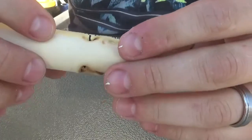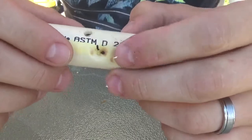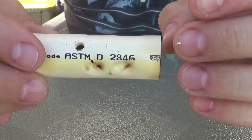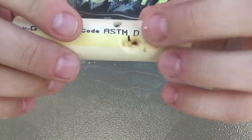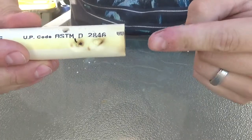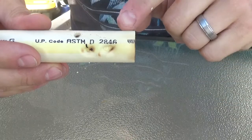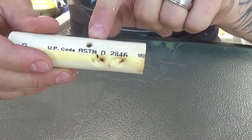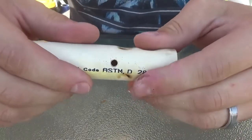This is a good time to talk about how this thing works. We're going off a principle in physics by Bernoulli — Bernoulli's principle, basically the venturi effect — which states that as water is passed through a restrictive area it becomes faster but with less pressure. Water coming in at higher pressure passes the restriction at faster velocity and lower pressure, and on the other side of the marble there's going to be a vortex that sucks in air.